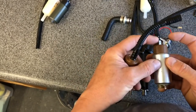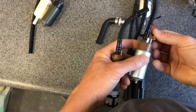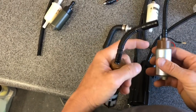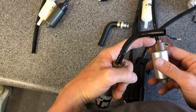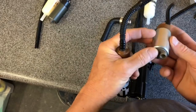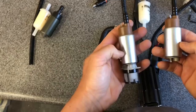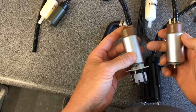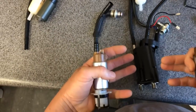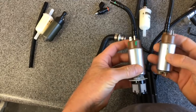I've also seen bikes that won't run because a tab breaks off or the little tabs on the wiring don't make good contact. The plastic upper assembly can snap off. All of these can happen — it's not a given that these failures will happen to you, but they do. The remedy is to replace just the pump motor, not this entire assembly. You can do a little surgery and replace the motor itself.